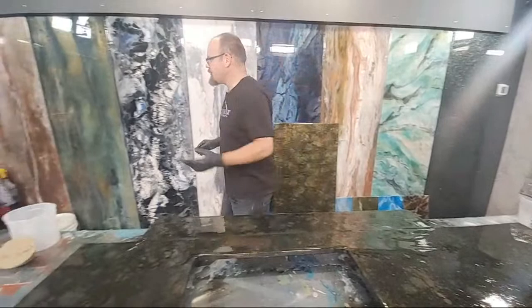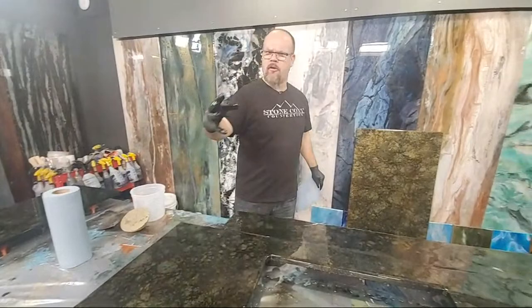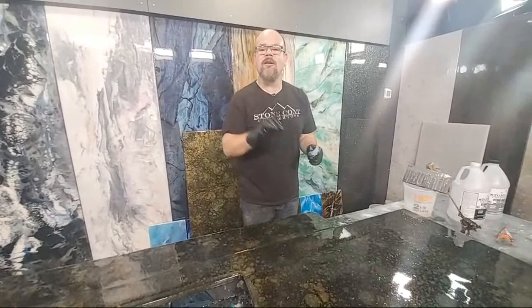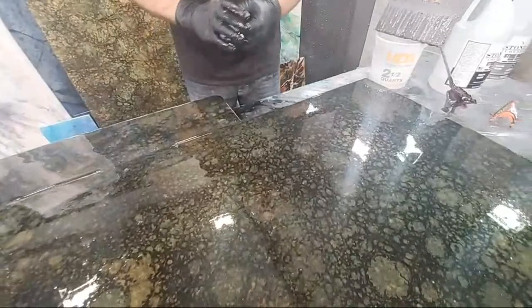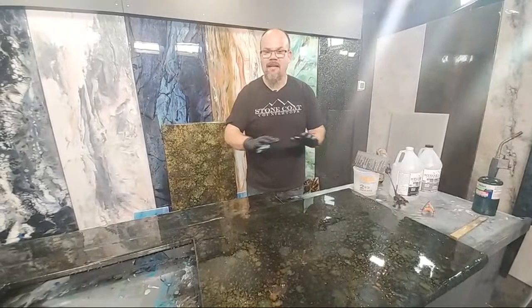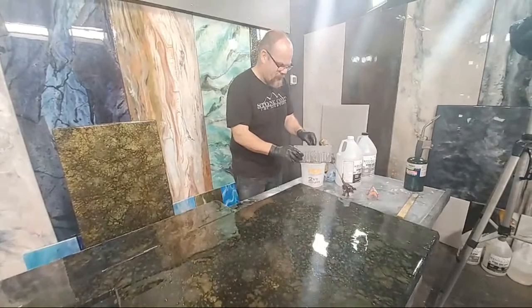Time to chop the surface. Why do we chop the surface? Two reasons: whenever you use that trowel, you're going to leave little trowel lines in your epoxy, even on a clear coat — you can see little iridescent lines. By chopping the surface, we break those lines up, and we also mix it one final time. It agitates that material, mixes it, and breaks any surface tension around the perimeter — that's usually your culprit of a void. I overlap all of my brush marks over the edges and in the field, so when I torch this, it's going to lay out like glass.